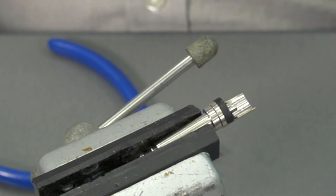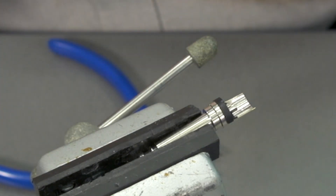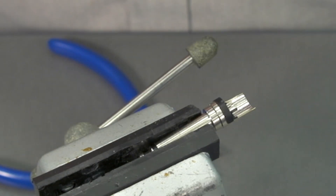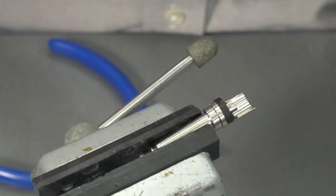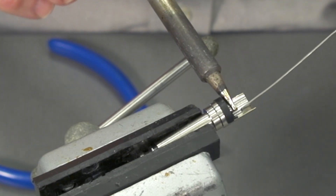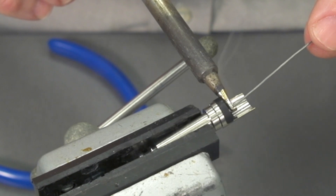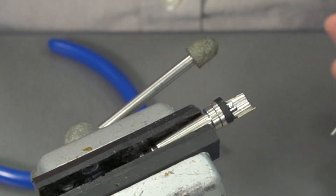We take the iron out of the holder and clean it off in the sponge, making sure it doesn't get caught up in the tools. We're going to add some solder back to the tip after we've cleaned it off. I'm going to lay the soldering iron across the top of the cup and flow the solder into the cup. We want to fill the cup — not to overflowing, just about like that.